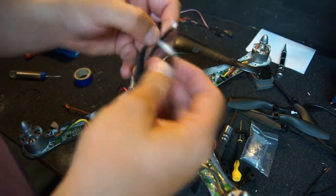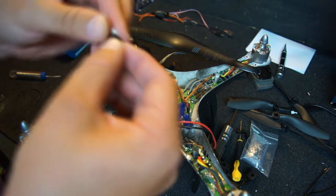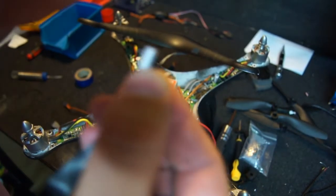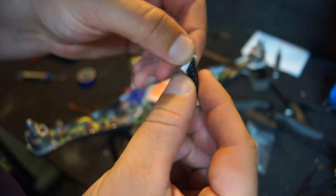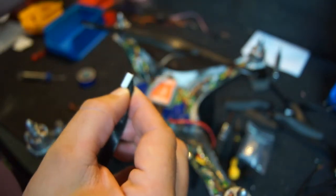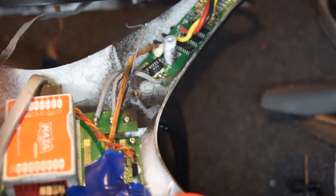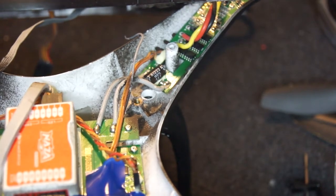Next step: let's get our cables. We're going to take this long power and data cable here. You have to kind of scrunch it in a funny way — let me just focus in on that. You see how it's flat? You need to kind of twist it and make it pointy with the cable, and now this needs to go down one of the legs. You have these rubber bits right at the start — you can see you've got a rubber stopper. You can push that through, and we've got a hole to stick the cable up through and into the Phantom.